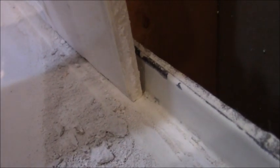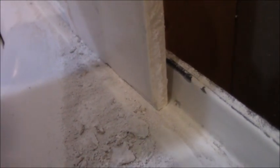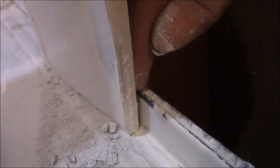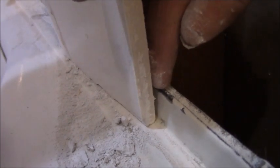So when the wallboard sits on there and the tile overlaps that, the wallboard's going to bump you out about a quarter inch or so. That and the thinset's going to bump you out, and then this tile will rest right on top of there with your wallboard sitting right back there, where it has absolutely no contact with the surface where you're going to see water. So that's the proper way to do it. Otherwise, you're chasing this mold and mildew forever.